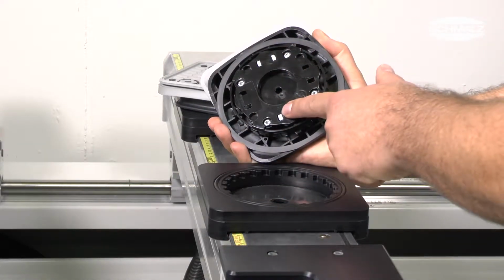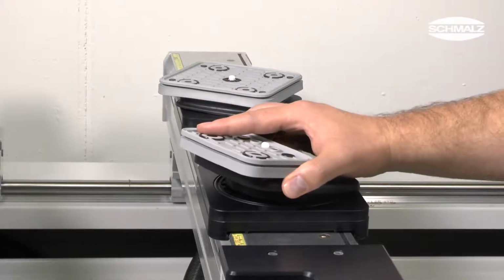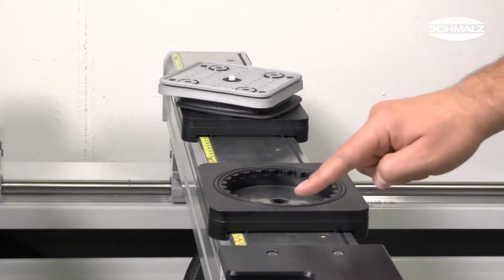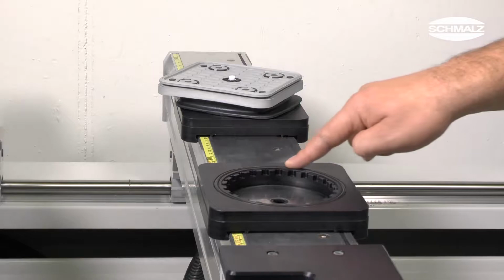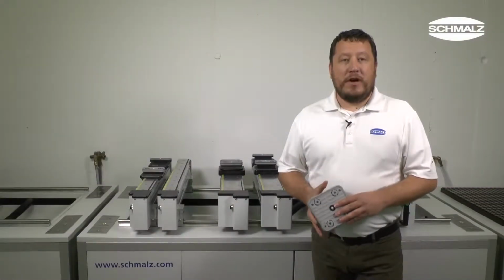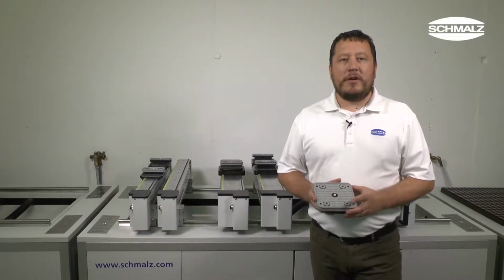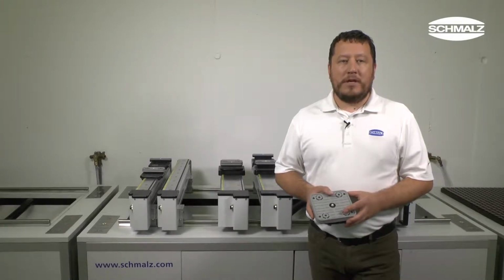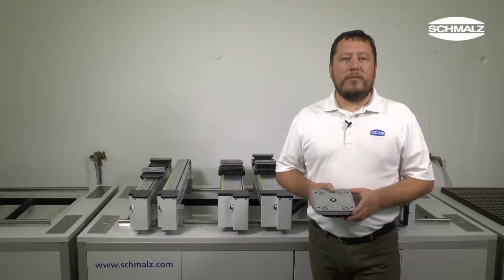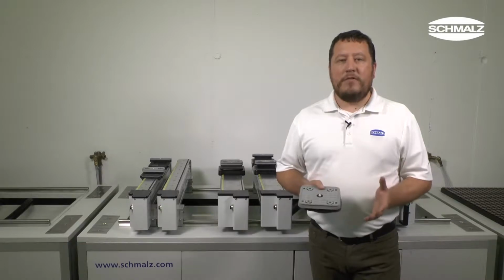Magnets in the adapter ring of the VCBL-B are attracted by this metal sheet to give the block additional prefixation within the APS4. Be sure to keep this area clean, as the O-ring seals the vacuum block against the adapter plate. All Schmalz vacuum blocks are made of highly robust material, machined to an unchallenged accuracy and height. In combination with the APS4, the maximum tolerance is 0.1 mm. This will help you to produce a top quality product every time.